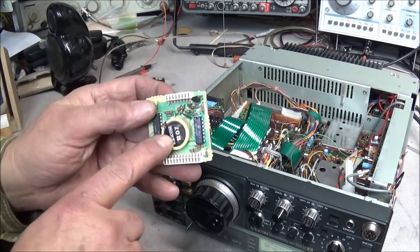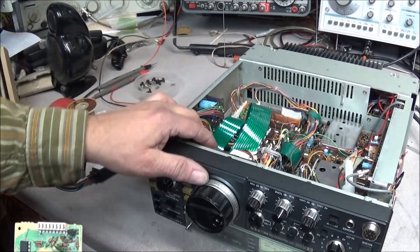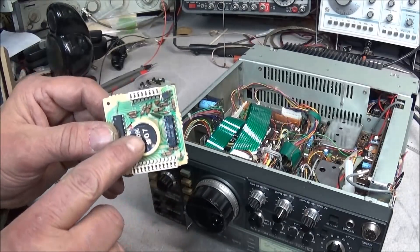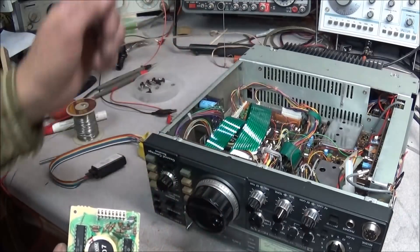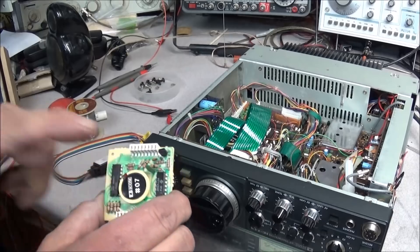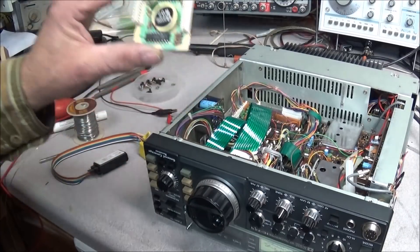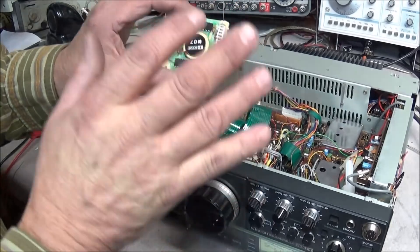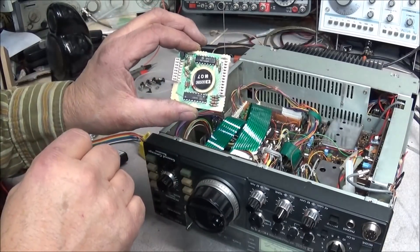There are different things you can do besides putting this battery in here. I've seen people put a AA battery pack with two AA batteries and run two wires down — keeps this thing powered up for a while. You can also put a new coin cell in it. If the battery ever goes dead, you've got two AA's you can change out from time to time to keep it backed up, then replace your coin cell. I like having the original board working because, old school, it's still cool. That's why I want to come up with a modern way to talk and write to this original RAM board.